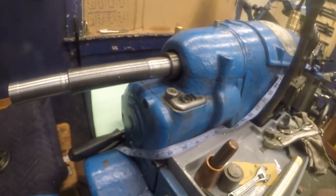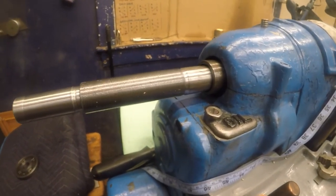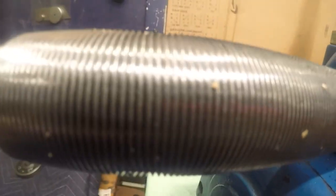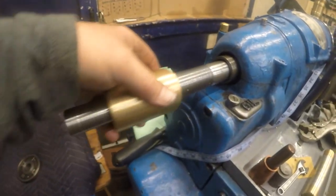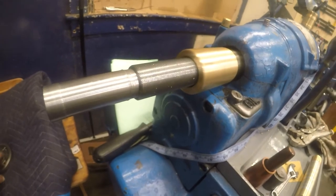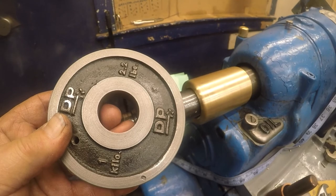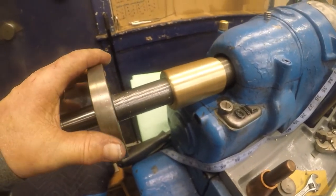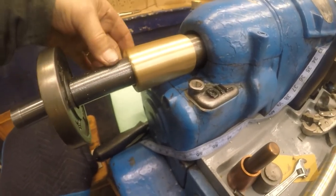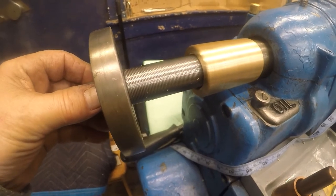And I'm not sure what you're seeing, if this button will work. So here's the other end of my drawbar. And so the collar goes on. I'm going to put a flanged bushing in here and then thread it to go over here. Tighten up on that, pushing that, pulling the drawbar out, and then work out some kind of jam nut on the back here.